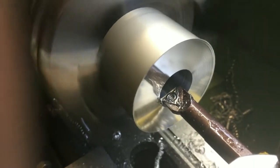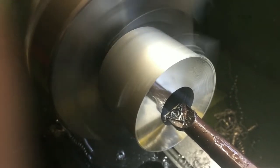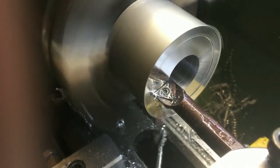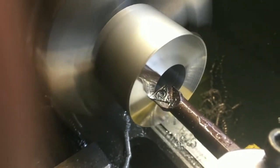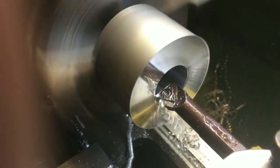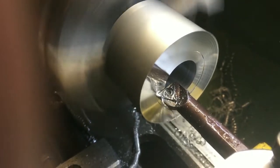So I've turned it round in the chuck and now I'm going to face the other side — I've done a couple of scratch cuts already. I've set a zero on my DRO at where I want to be, and when I get down to zero that will leave the overall thickness of my part one millimetre oversized at 35mm. My finish size is going to be 34mm, and I'll do that final cut once I put it on the mandrel. I'm using the boring bar to face it, so I can do it in one operation — face and bore in one go.